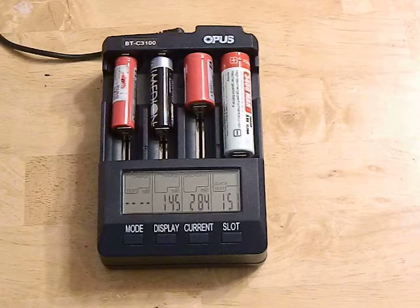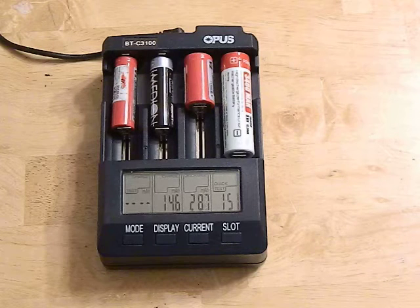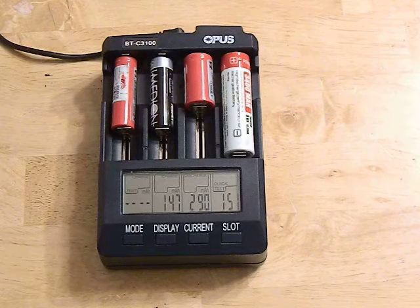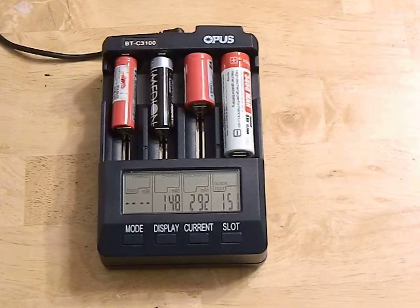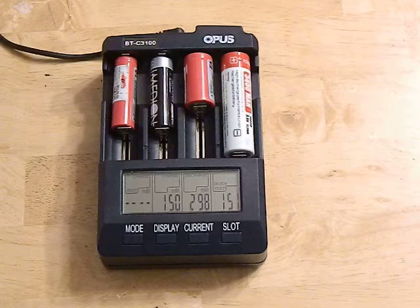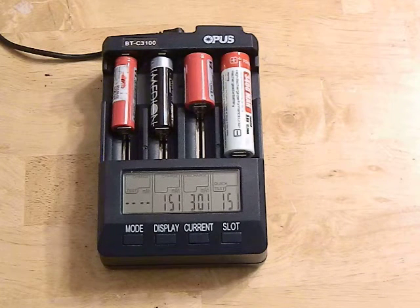I had no overcharges, and trust me, I ran this thing a lot. Safety is the most important thing to me beyond features — if you can't trust it, I don't want it. I tested it extensively with batteries of different kinds and voltages at both two amps and 200 milliamp settings. I did it safely by placing the charger in a large stock pot with a lid to contain any potential fire or explosion. I found no issues with overcharging.